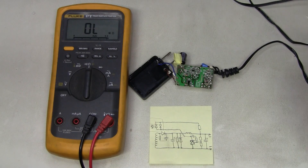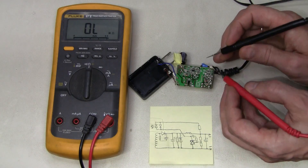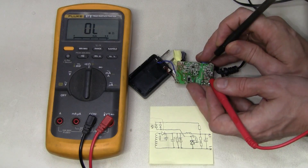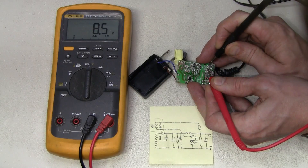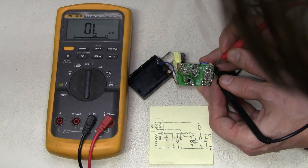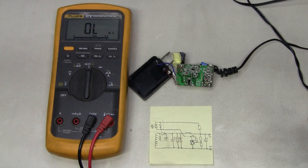And look at this. I am checking across the Zener-based reference — anode to cathode — and I'm getting 5 ohms. And here is the optocoupler: 8.5 ohms. If we swap the probes to check both ways, we get the same thing. So something is nearly shorted around here, and it's hard to tell what exactly. Probably the reference — so let's desolder the reference and have a look.